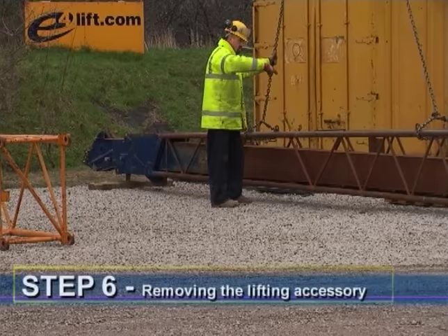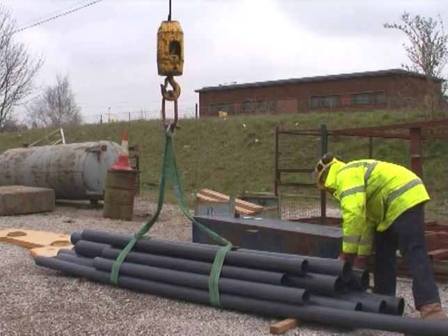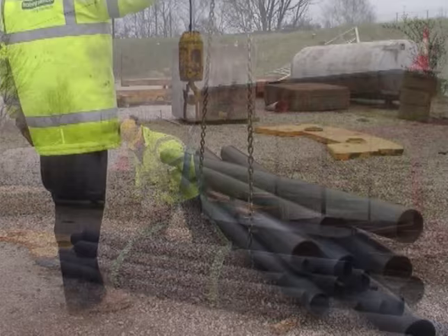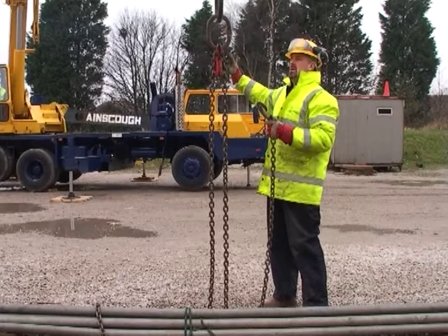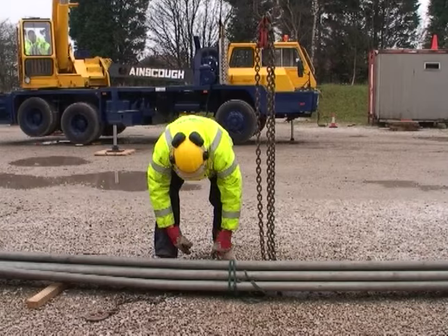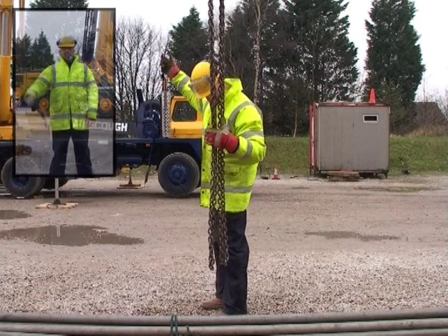Step 6: Releasing the slings safely. Now it's time to release the slings safely. Ensure that the sling legs are not under tension. Timber supports make the removal of the slings easier without the need for the crane to drag them out — dragging them out damages the slings and can pull the load over. Once the slings are released from the load, hook back the sling legs to the master ring. Hooking back the legs prevents the risk of being hit by the swinging legs. Signal the crane operator to hoist the slings up slowly and guide the sling legs clear of the load and any obstruction until they are above head height and can be seen by the operator.